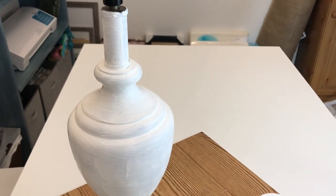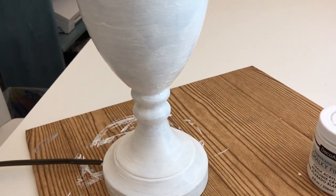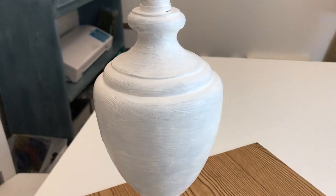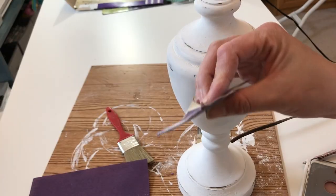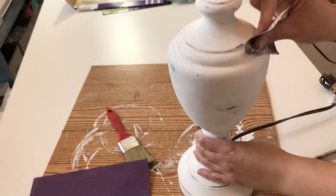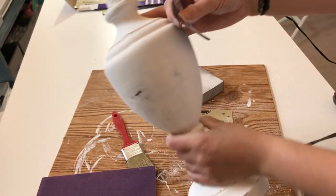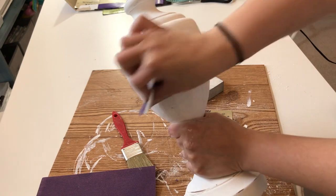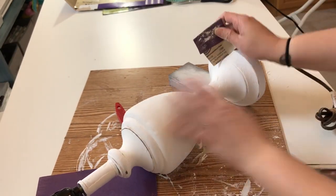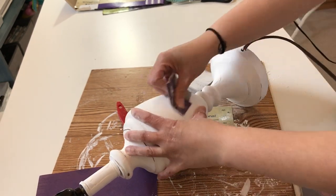But then I added another coat and it started looking a little bit better, only the paint started accumulating quite a bit as you can see here. This is the third coat. Now I knew I wanted a distressed look, so I got a 180 grit sandpaper and started sanding away, getting rid of all those brush strokes and having some of the old color peep through. It did take a little bit of elbow grease because a lot of areas were kind of built up, but it ended up looking really nice.